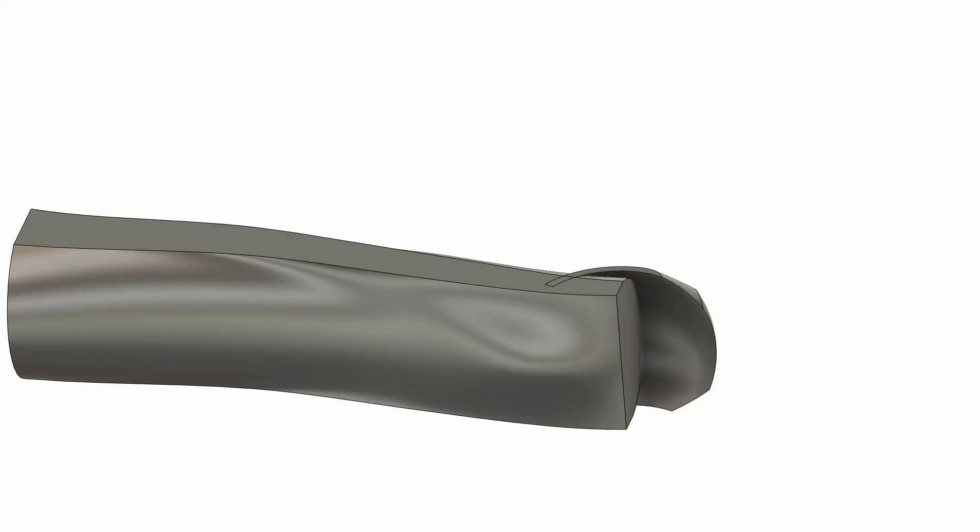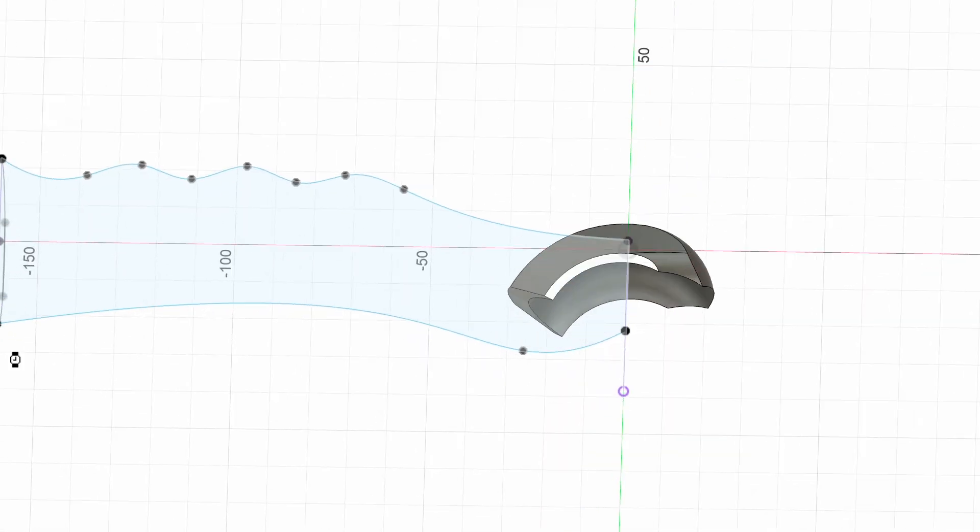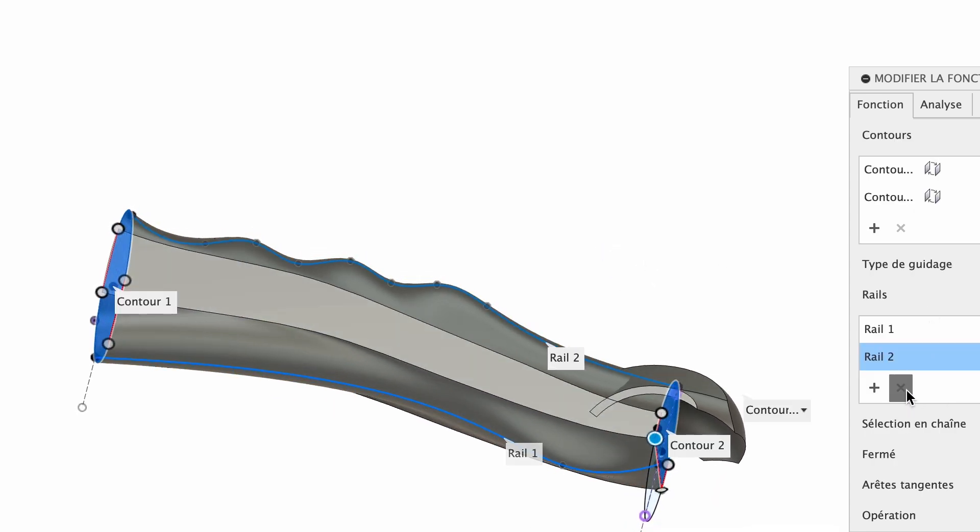Materials like wood cutting boards that have had fish blood on them can be rinsed off with water and be fine. 3D printed parts can be perfectly food safe so long as they're printed and designed well, without opportunities for contamination to get in. If you design with bad fillets at the bottom that create permeations in the exterior shell, stuff can get into the part — but if you design it uniformly with a nice cohesive outer wall, it's not really an issue. Food safety really just depends on the design of the product itself, not the process by which you make it. For something like ice cream, it's a very common utensil type — like cookie cutters or measuring cups — that can be very reliable and safe for normal people.